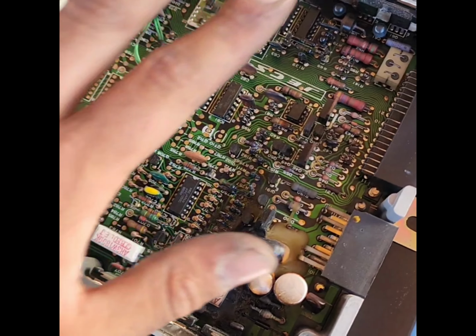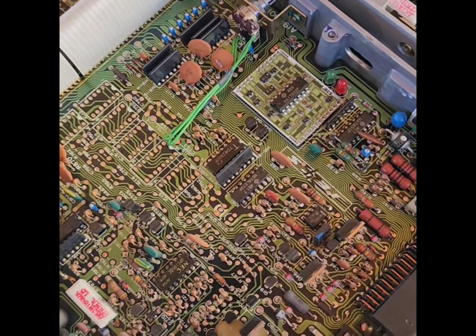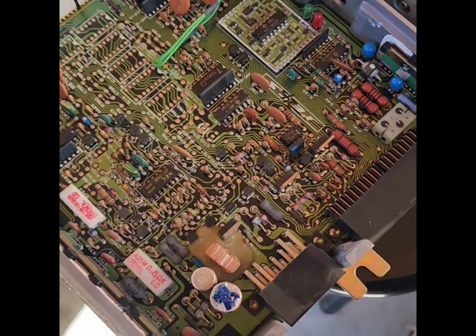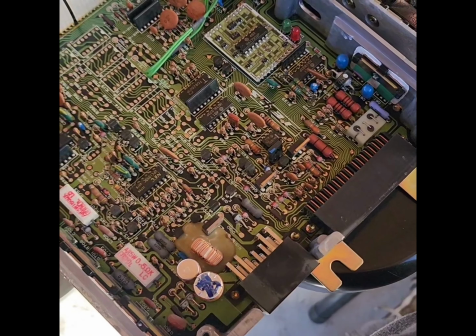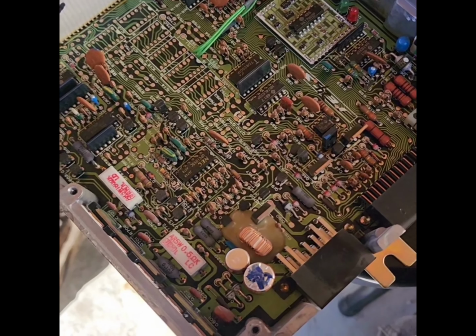So this right here is the junkyard ECU, trash, I don't care. But this is the ECU that I had in my car that was currently running, and then I grounded out going 85 on the freeway, and then I had no power. Moral of the story is my injectors are not talking to the actual car itself, as well as the idle air valve and the cylinder head temperature sensor.